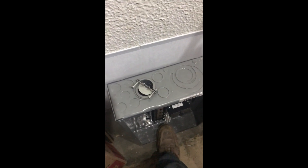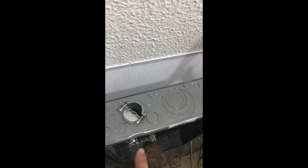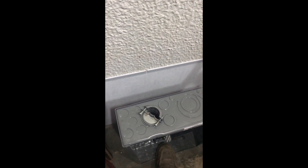The next step is to prep by putting your connectors in the top of the new box. I like to do about four wires per connector. This is going to be for the service entrance — double inch-and-a-quarter, that's about the standard size. Then use the three-quarter-inch knockouts. Don't go smaller — the half-inch knockouts are just a pain to get things through. Four wires per three-quarter-inch connector and you'll be all right.